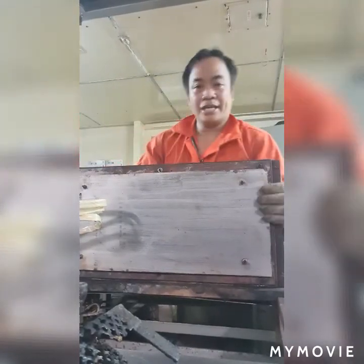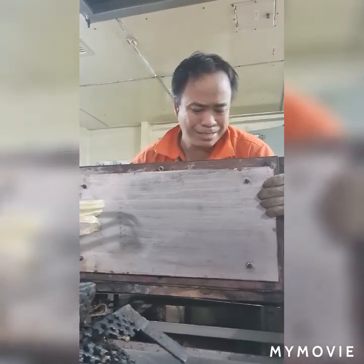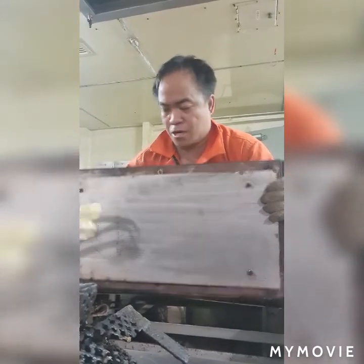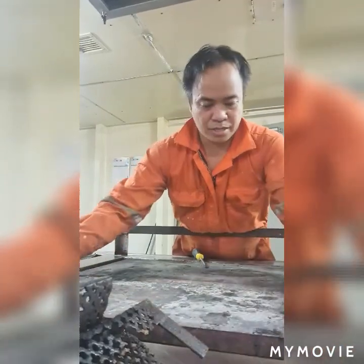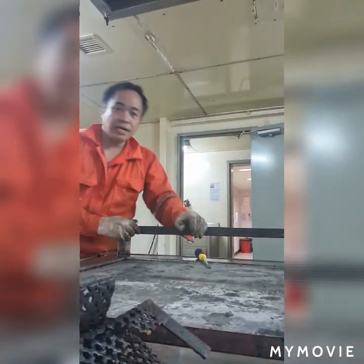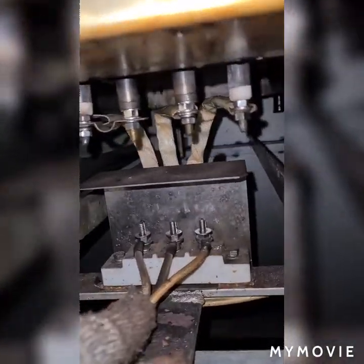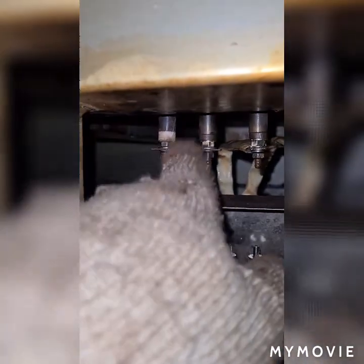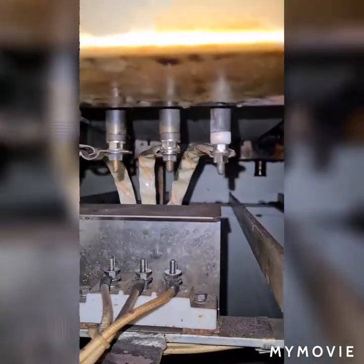This is very heavy — I need to be careful in putting this one. You must go slowly, like this — this is very heavy metal. I'm going to fasten down all the bolts and nuts. Down side here I have three power terminals — line 1, line 2, and line 3. That's why I make these two jumpers together. Line number one, line number two, and line number three — this is a three phase, 440 volt system.